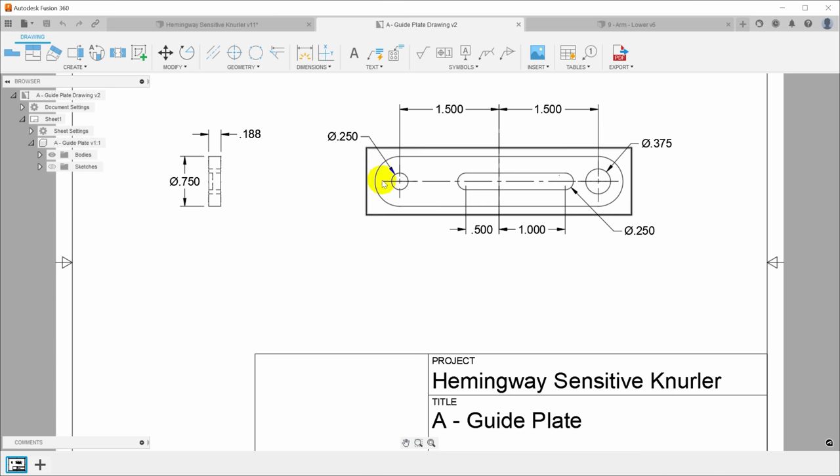I've established a datum in the center of the part and have everything dimensioned from that datum. It makes things a whole lot easier - I can find the ends of the stock, drive to coordinates with my DRO, and it reduces the number of mistakes I'll make building it. I'll still make mistakes, don't worry - you'll still get the entertainment value from that.